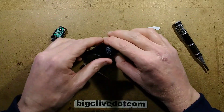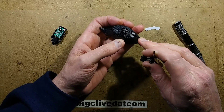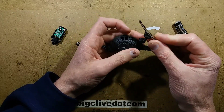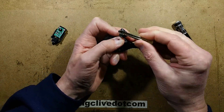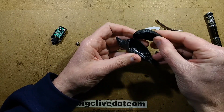First thing, I'll show you how you get it out of this thing. If you do what I do and you just say, okay, I need access to that screw and you pull the legs off — they just snap off because they're glued in. To get access to that screw there, you pull this clip out and then you can get access to the screw. But unfortunately at that point, although you can get it open, it is glued.